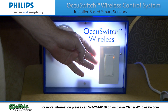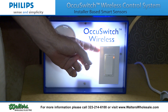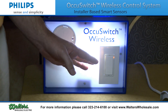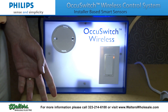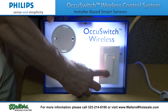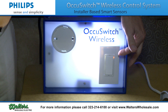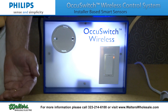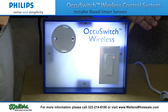The second part of the system is our switch. The switch is a wired switch and does require a neutral. It is capable of having manual on or auto on capabilities, so it can function as a vacancy sensor or an occupancy sensor. I can also override the system — I can turn the lights on or off, and the amber LED on the side indicates that we're in override mode. The override mode stays in effect until someone leaves the space and triggers it back into automatic mode, at which point the amber LED goes off.